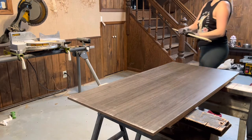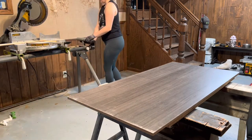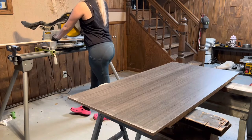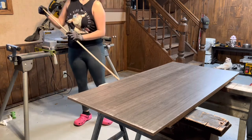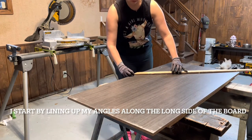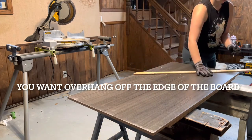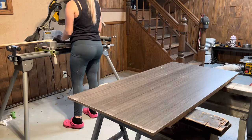As you're making your design for this project, you're cutting all the pieces at 45 degree angles and then lining them up roughly on the board how you want the pattern to be. You can follow an X pattern, the long side, or the short side of the board — pretty much whatever you want with straight lines. You can also add dimension with different lengths and stain colors for visual interest. I'm starting in the very center of the board with that first piece, doing a rough layout of how it's going to look, then taking a pencil to mark where I can cut the excess off and use that leftover piece elsewhere on the board.